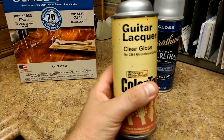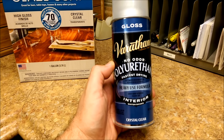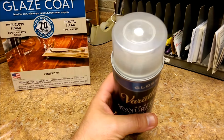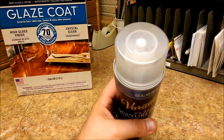This stuff here I used on the green guitar build, another Les Paul. It was sprayed on the neck, headstock, and the back. The front of the guitar I used basically the same brand but a brush-on type of polyurethane called 3X - one coat is like three coats, so it goes on very thick, levels itself out, and ends up a very nice gloss finish. This spray version, though, can come out milky - heat will fix that. Just go over the area very lightly with a heat gun and that cloudiness will go away.